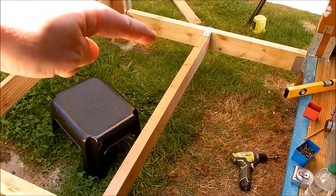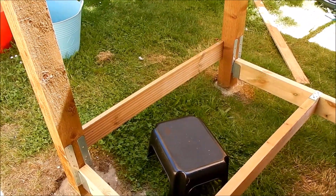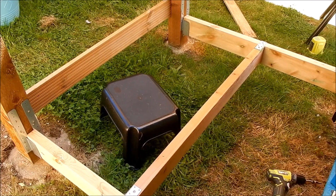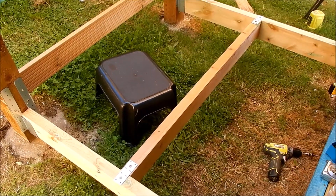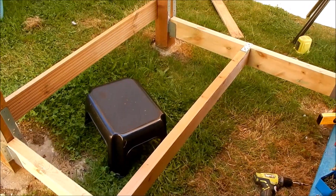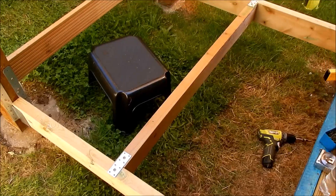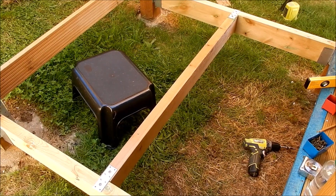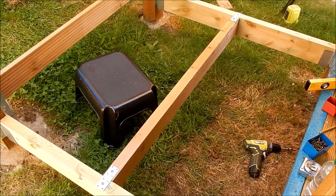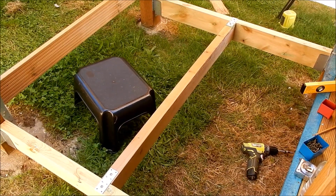The nominal distance between the two five-by-twos is the distance between the posts — 1100mm — plus the fact that these are two inches each side, making 1150. But I've added three millimetres extra because these five-by-twos are actually 47mm wide, not 50mm, so I've gone for 1153mm for the length of the four-by-two cross beam. I'll cut two more, mount them, and come back.